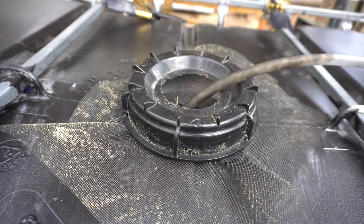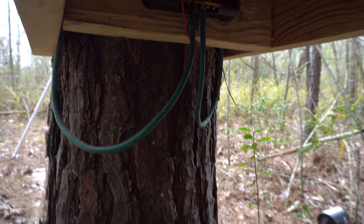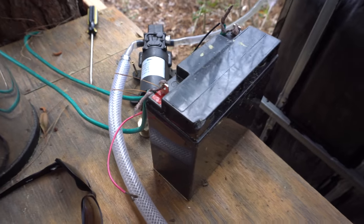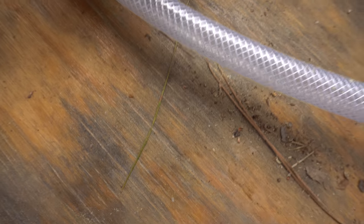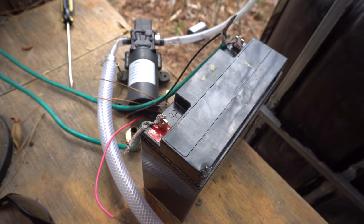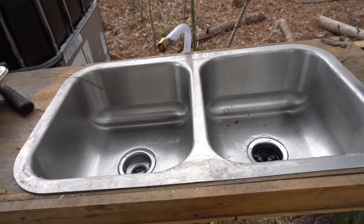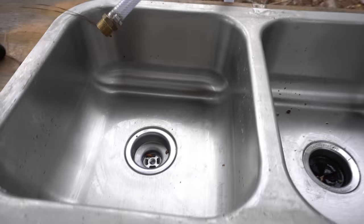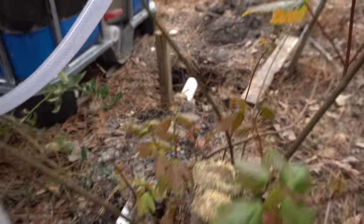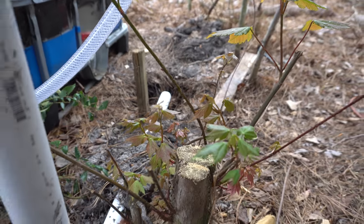Here's how it all works: there's a small 15-watt solar panel, and down here I have a small battery charge controller mounted to prevent the battery from overcharging. The solar panel goes through the charge controller and up to a very small battery. Then we have a really small water pump — to turn it on, I just touch the connection and you have water pressure. I also installed a sink in my outdoor kitchen — I got it from Habitat for Humanity for 15 bucks. The water comes from the pump via a hose. Right now it drains into a hole, but we have a lot of clay out here so it doesn't drain well; I might route it way out into the woods to get food particles and sediment away from the area to prevent bugs.